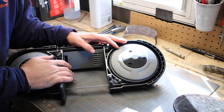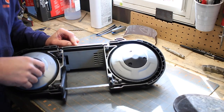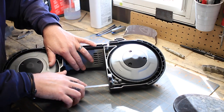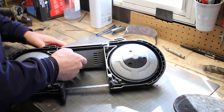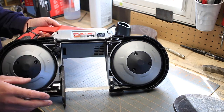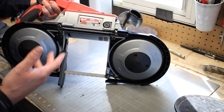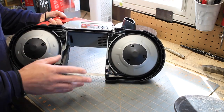This is my Milwaukee portable bandsaw. This one is catalog number 6238-20. It's a 2-speed, 7 amp or 11 amp, and it's a 4.5 inch cutting depth — so that's how deep a cut you can make before your material runs into the body. Really, really simple to use. There's nothing to adjust on it. Your blade tension is right here and that's just a lever on/off. You don't really adjust it, you don't need to do anything. There's no tracking required. It's got ball bearing followers just like any other bandsaw would.